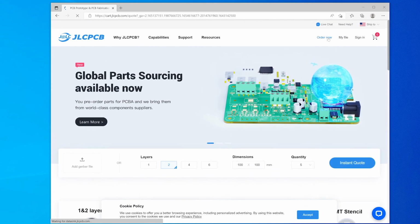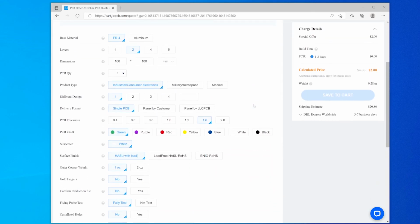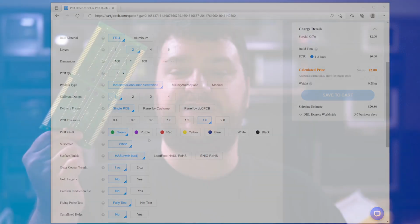And at least now you know, if you want to make yourself a game cartridge PCB from JLCPCB, it's pretty easy. You just have to make sure to modify the design so it makes the minimum width so that their machine can do the beveling and chamfering properly.